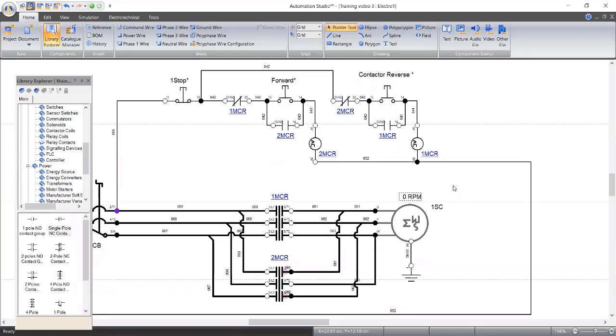Remember, when our coil was working, it generated a magnetomotive force. That means there is still a magnetic field inside. And remember, immediately I stop, our motor is still spinning due to inertia because there was no load on it. So that spinning is cutting across that magnetic field and is generating what we call back EMF. So it's giving voltage back. Instead of being the motor, it's now the alternator, the generator generating voltage.